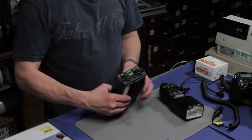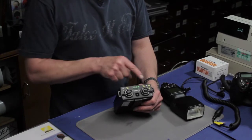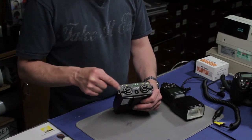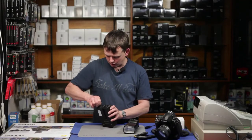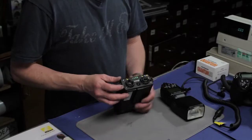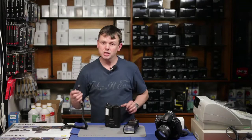On the top of the battery we have a flash symbol and a camera symbol. The flash output is high voltage — 325 volts. The advantage is that rather than little double-A batteries having to build up charge in a capacitor, it effectively delivers high voltage which bypasses the capacitor, allowing the flash to recycle in just a fraction over a second at full power.